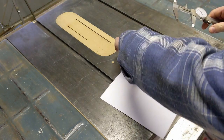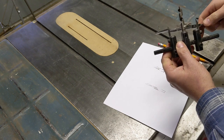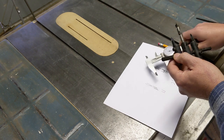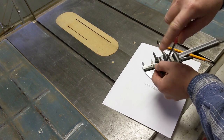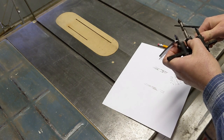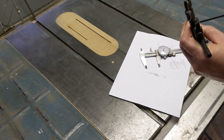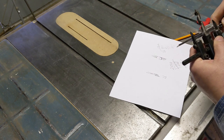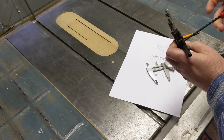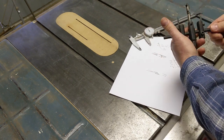So we're going to set this to 1.430 inches using a caliper. This caliper is about $25; you can get a digital caliper for $10 on Amazon. I can't imagine any woodworker or any type of worker who would not have use for a modern, highly accurate caliper. From the shaft out to the outer blade: 1.430 inches. For the inner blade, we'll set it to about 1.40 — about 30 thousandths to the inside — which gives us that extra-wide kerf we need. The exact width on the inner one is not as critical; it's just clearing the kerf for us. The outer blade is creating the final hole.